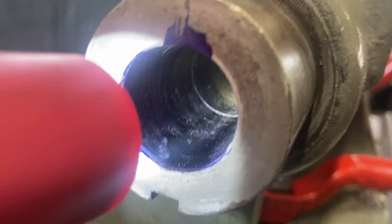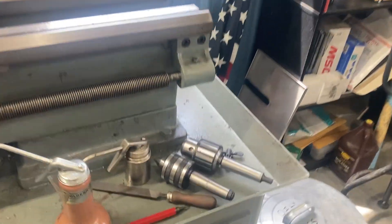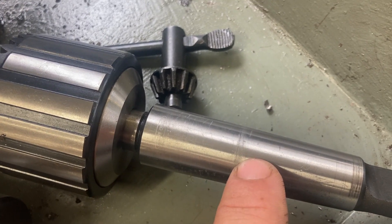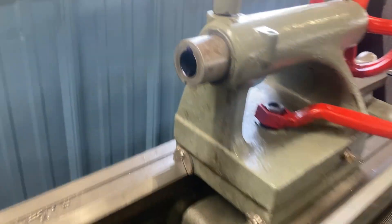The situation is worse than I thought. I'm contacting about maybe an inch and a quarter down in, and then further down it's clearing in the back. This confirms something I was already thinking about with this machine, because if you see on some of the tooling where it's spun before, it's only contacting on a few areas. So I'm gonna have to actually take off more material than I'd hoped. I was hoping there would only be some high spots, so let's keep going.